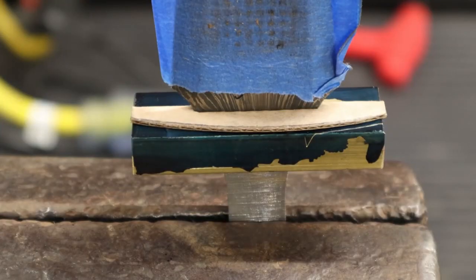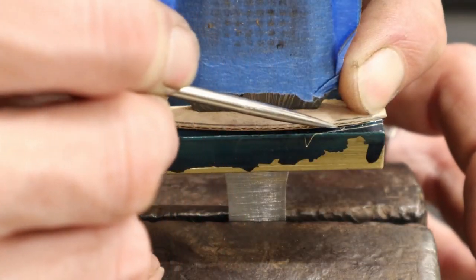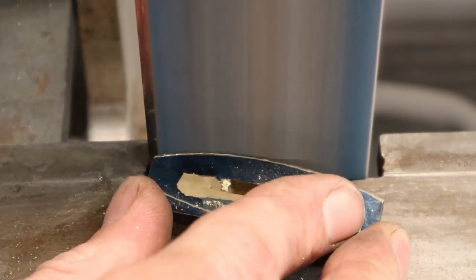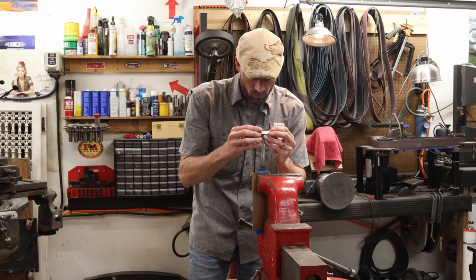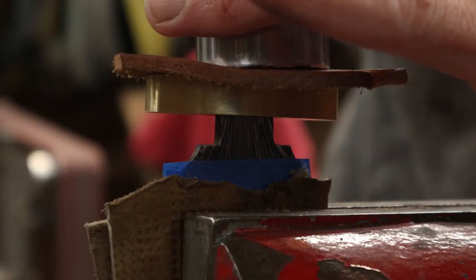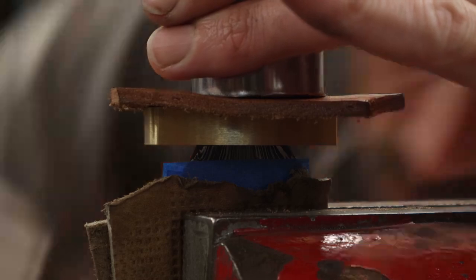This is one way to shape a guard. I'm gonna go ahead and put my layout dye on there and I've made a cardboard template. I slide the template up to the knife blade and scribe it, then I'll flip that template over to the other side of the knife blade and you get this symmetrical pattern. I'm gonna go ahead and grind the circumference all the way around before I mount it up. You'll notice when I slide this guard on it doesn't go all the way home without me having to drive it on with a mallet — that's a good fit. It comes right up to the shoulders. Snap. Perfect.